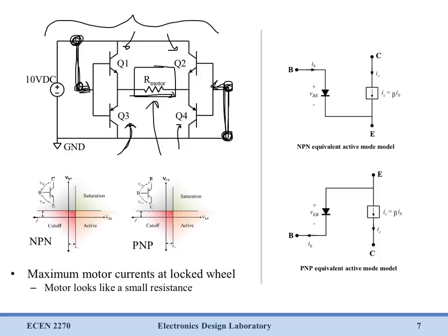Looking at the operating modes for each device, let's take Q3 first. Q3 is a PNP. We notice that the collector is at zero and the base is at 10 volts, which means we have a very negative collector-base voltage — we're really far down this line. Since we're either in cutoff or active, we look at the emitter-base voltage to determine which. Our base is at 10 volts, and to get active mode we'd need our emitter to be above the base voltage — a positive emitter-base. But since our base is at 10 volts, it's pretty unlikely this node is going to be above our highest voltage rail; there's really no way for it to get there. So we can safely assume Q3 is in cutoff, and we can simply remove it from the circuit.